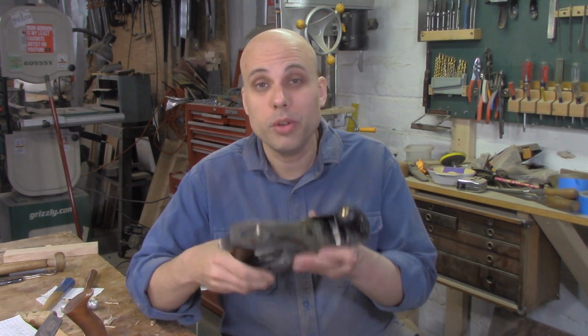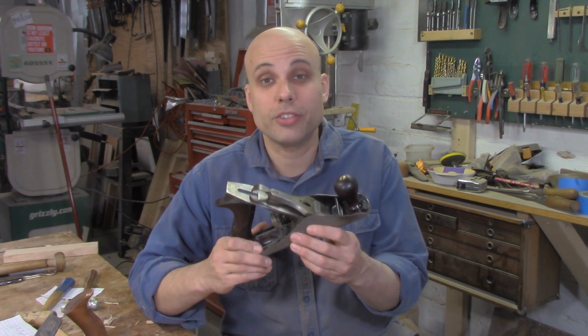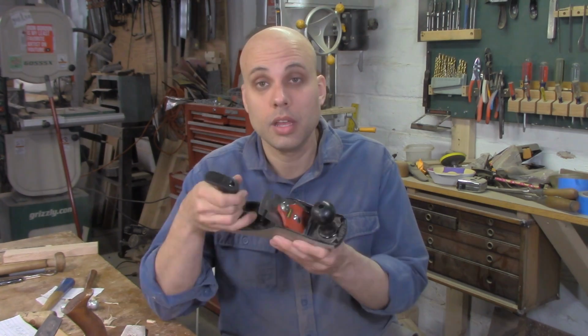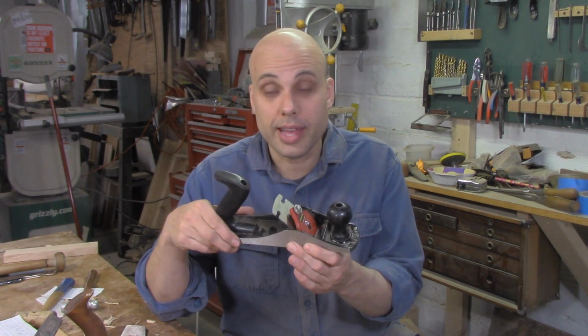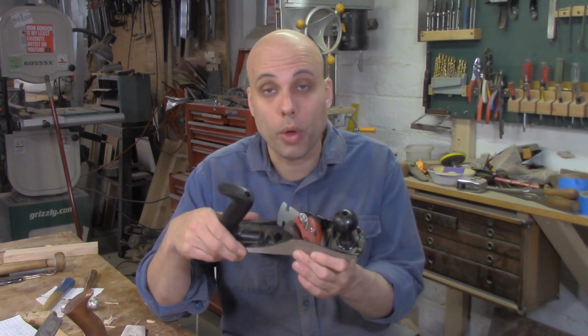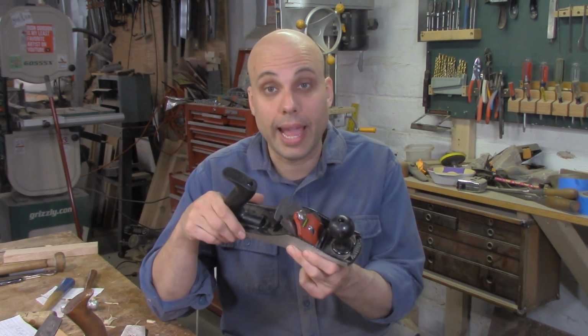And so along with my wooden planes, I always have a number 4 or a number 5 because they give me such incredible versatility, and I can get that versatility so quickly. The 404 is a completely respectable plane, but it's a lot like a wooden plane. Once you get a good setting, you're really likely to leave that setting and just sort of live with it no matter what work you're doing. The convenience of a metal adjuster is really lacking here.